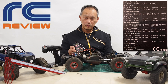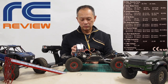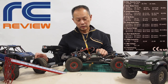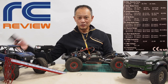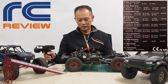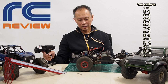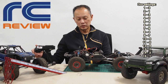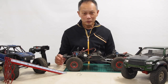Hope you found that useful. When you have your settings, you hit the OK button, then turn it off, take the wire off, and turn it back on. Really amazing part of the Hobbywing ESC — forty dollars and it includes this programmer piece. You don't have to use a PC or some crazy LED system. Everything we programmed gives it all the punch but also the slow start we want from a crawler, and the cheap servo is happy running at 7.4 volts. Hope you enjoyed the video, thank you.